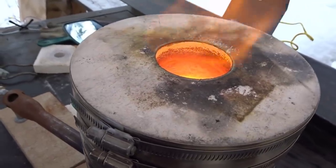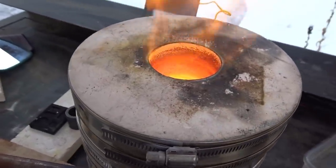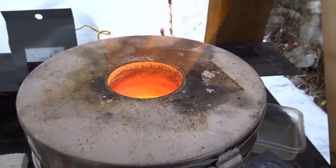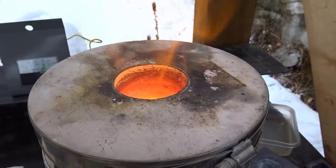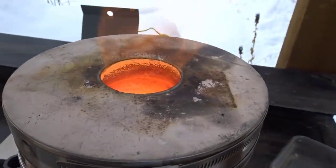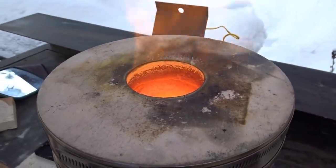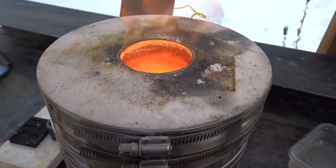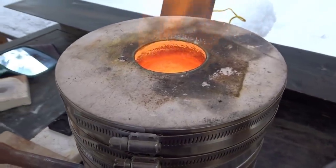Black sand is an oxide, a sulfide is like a pyrite, and if that's the case, those are much more difficult to smelt. Luckily there's potassium nitrate in there, which will actually deal with the sulfides if they're there, but I see this buildup around the top ring, which might mean that they're present in that chunk of gold material that he gave me.